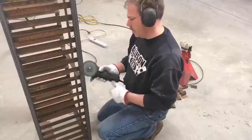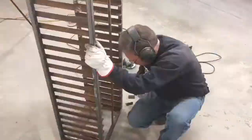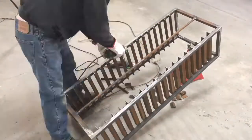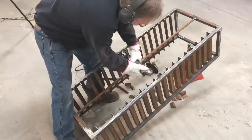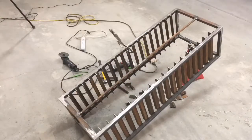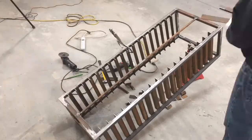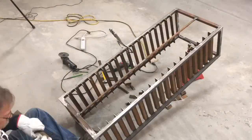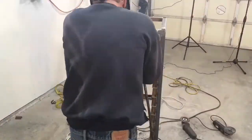So in this part, I'm just cutting loose the braces that I had welded on the back, and then I cut out the brace that I used to kind of square up the sides again. And then I come in here with a new piece of angle iron in just a moment and make a new back brace for the center — that straightens up those sides again as well as gives me one of the shelves for the back of the boxes.